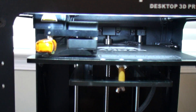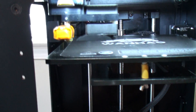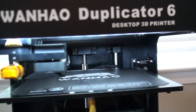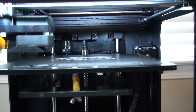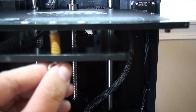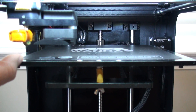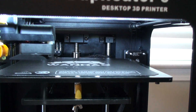This is proper leveling. The problem is on that second pass, the instructions and the LCD simply don't have the text ability to display the additional commands telling you that you really have to turn that knob and ensure that it re-homes the bed. Because if you don't do that step, you'll have an artificial gap. What you'll do is, because there's a gap with the bed plate lower than the limit switch, you'll mistakenly loosen the thumb screws and let the bed go up too high — actually above the limit switch level — thus crashing into the nozzle. This is really just an instructions update. It's a pretty simple fix, but it's just another way to do it. Thank you.